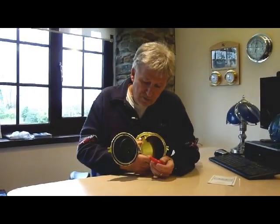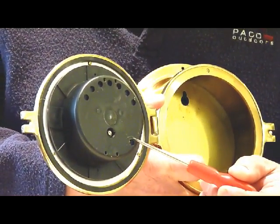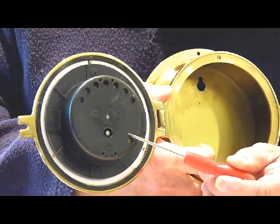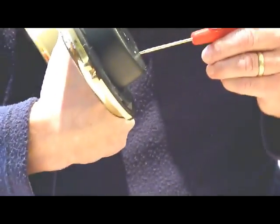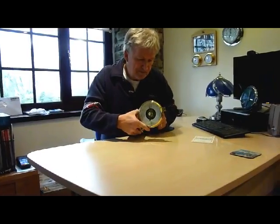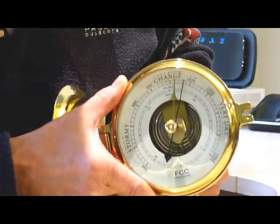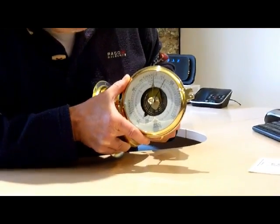When you open the door, at the back of the barometer you will see two screws. The one we're interested in is the outer screw, which is a brass screw and that has markings attached to it showing the rotational directions. I'll just put my simple screwdriver into the back slot, and now you can see that the black indicator, as I rotate the screw, moves in either direction.